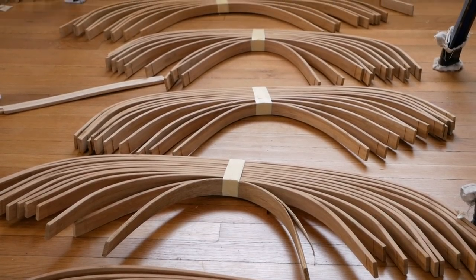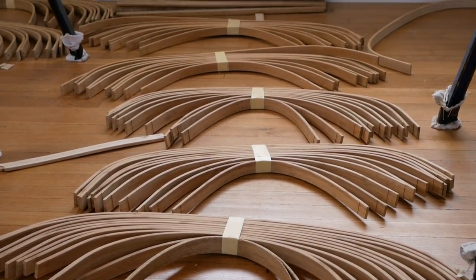4-day long nightmare where I ribbed these boats literally 12 times with 4 different kinds of wood, just trying it over and over. And some of them I wasn't able to get bent at all. Others I was able to get a good shape, but as soon as I released the center form, the canoe sprung open too much. And I realized that even though a canoe rib is a much more relaxed shape than a kayak rib, actually getting that canoe rib to hold its shape when you don't have the compression of a deck is a lot more of a serious endeavor.